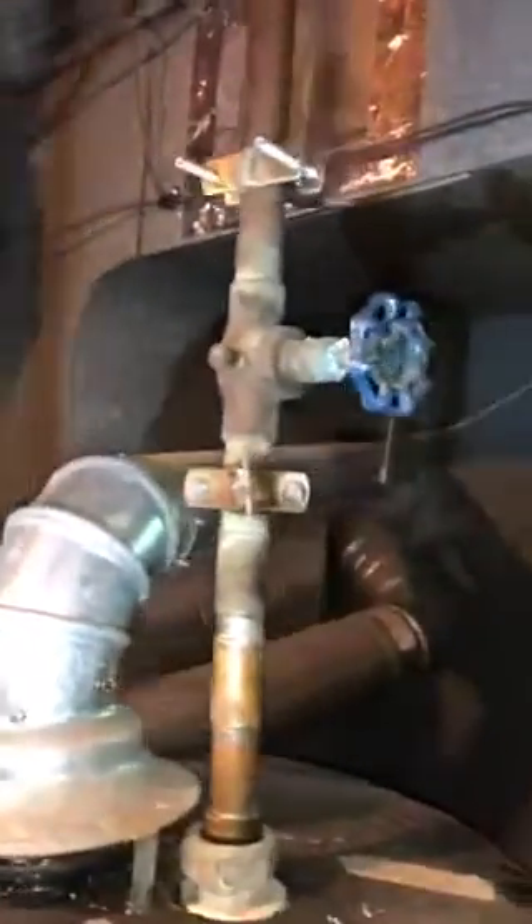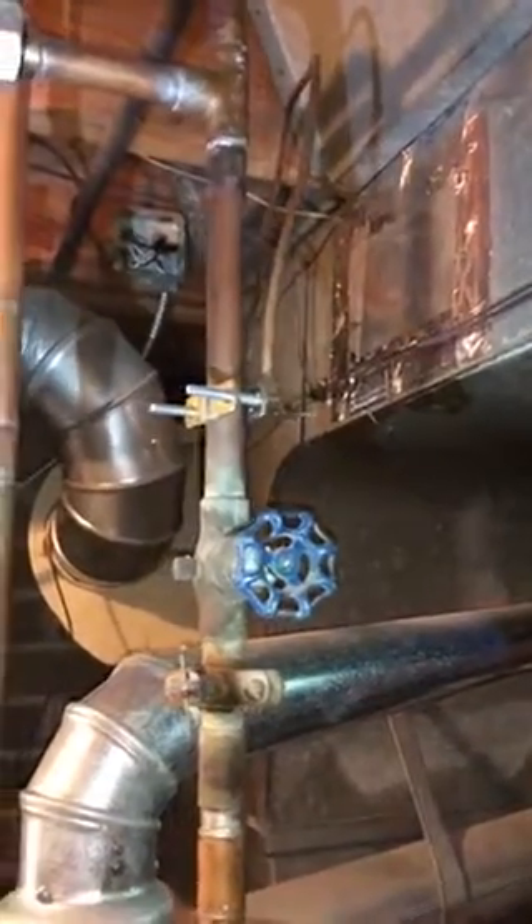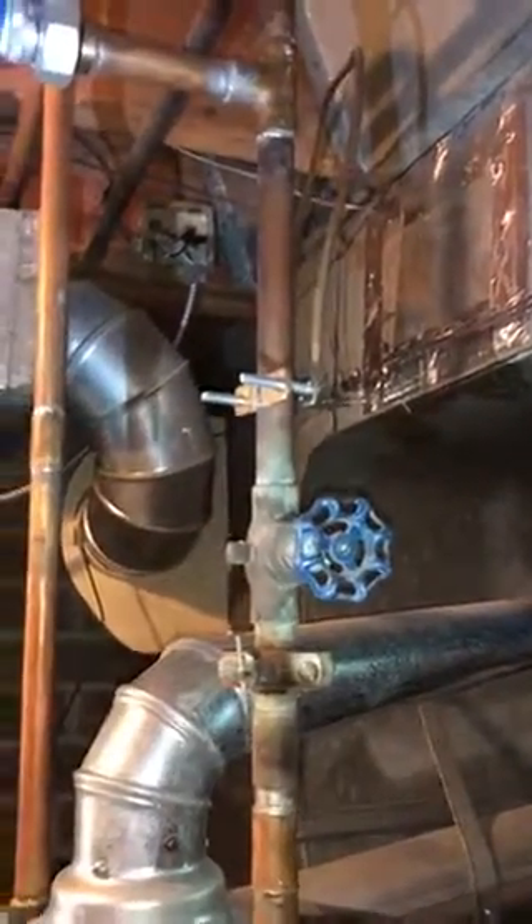The electric is pretty simple here. We're going to put a new humidifier. We need to replace the humidifier valves — if you guys can cut both of these out of here and put a new ball valve in on the humidifier. His furnace is sloped backwards, so if you guys can re-slope this thing a little bit, that would be great.